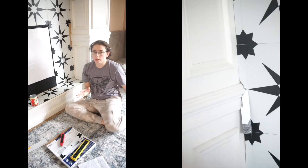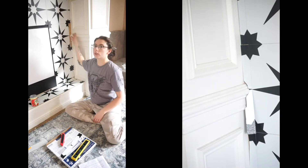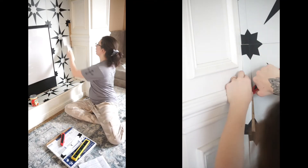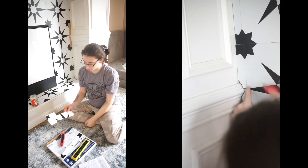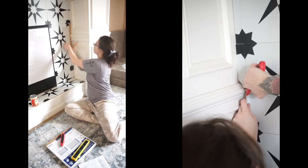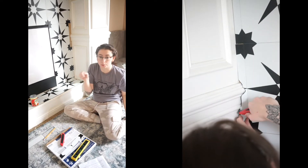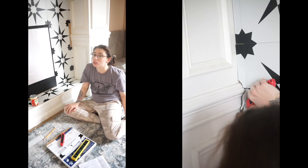This is probably the hardest part — trying to get it around this weird trim. I traced it with the Play-Doh onto a scrap piece and tested it out, so it fits and looks okay. Then I traced this onto the piece where it would lay. Now I'm just taking my box cutter and etching little pieces out at a time, because you don't want to do too much and then mess yourself up.